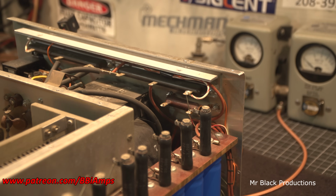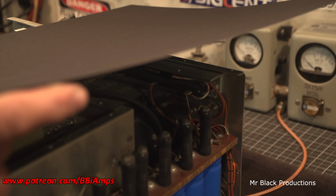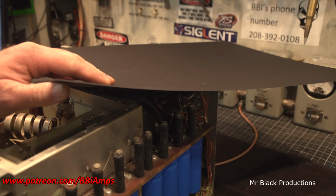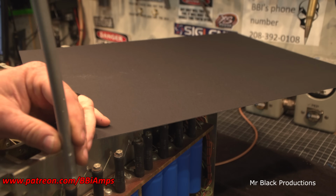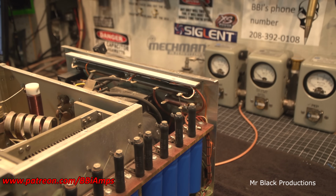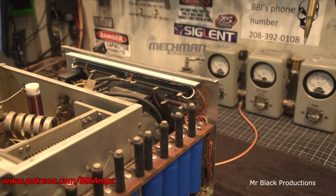So if all I've got to do is go down to my local craft store and pick up matte paper, look at how thick this is, and create myself a punch, cut me out some new paper and run some holes through those little dots, come through and replace all of these and make them new, right, and tight, I think I should do that, rather than going, oh yeah, let's just tighten that down.